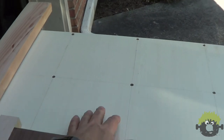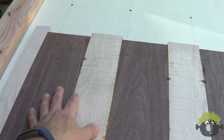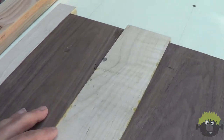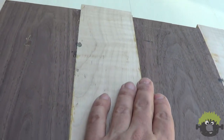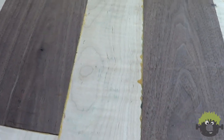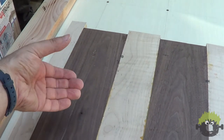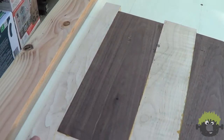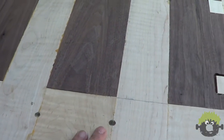In a separate effort, I had built this torsion box table surface thing, the idea being that it would be a very flat surface that I could reference off of. I needed to be able to resurface the back side of this tabletop. The glue up had left the back less pristine than the front, and I need to thickness that wood evenly so that both sides of the tabletop would be uniform.